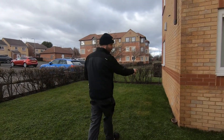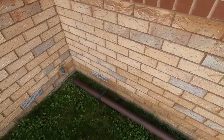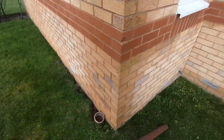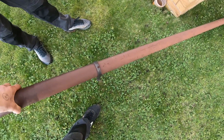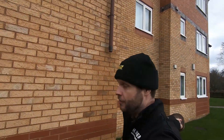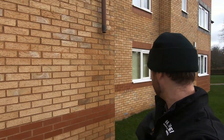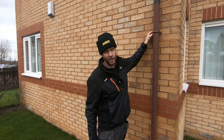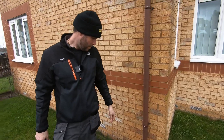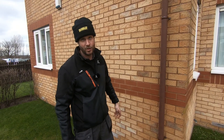Here we are, job number four. This downpipe here - you can see it there on the floor - just got to reattach that, nice simple job. There's only the one bracket on, the next one's up there above the joint. I think we'll fit an additional bracket here just for a bit of extra support. That's this one done - we've put the downpipe back on, put that additional clip on there just to give it a bit of extra support. New clip on the bottom, and then a little self-tapping screw in like what I had in before, just to stop the downpipe from dropping down into the drain, because there's no gully grid or anything on there. Job number four done - need to pop in there and do the emergency light test as with the others, but then that's just all done.